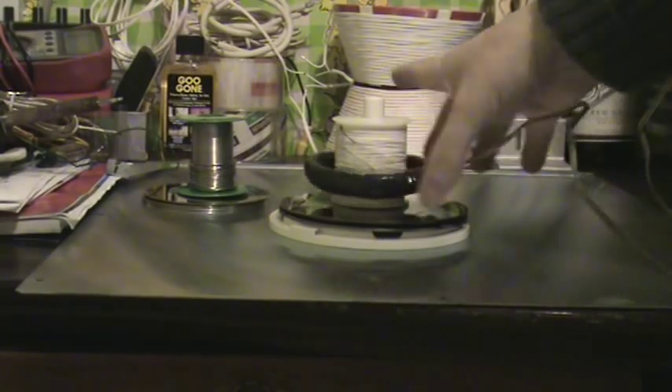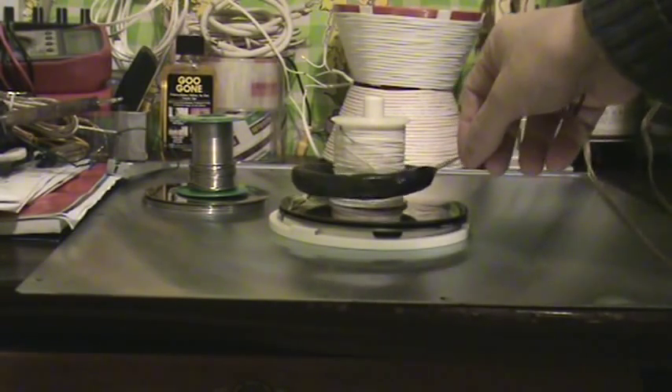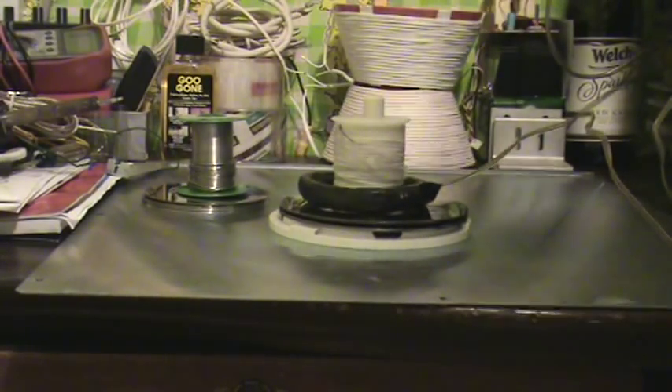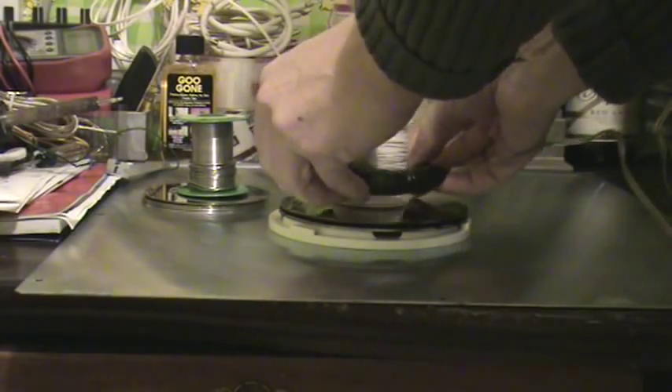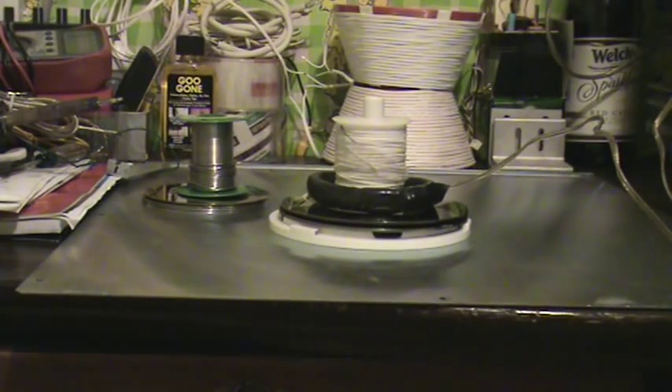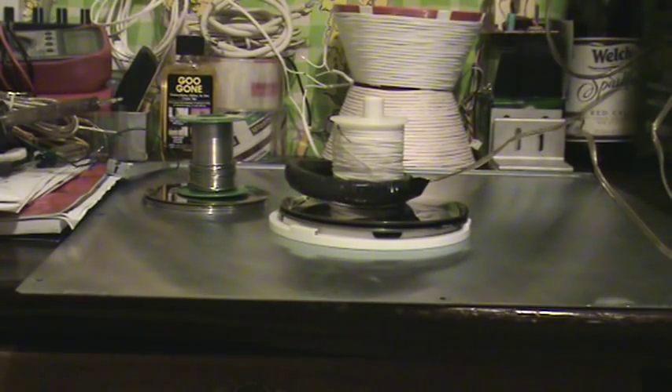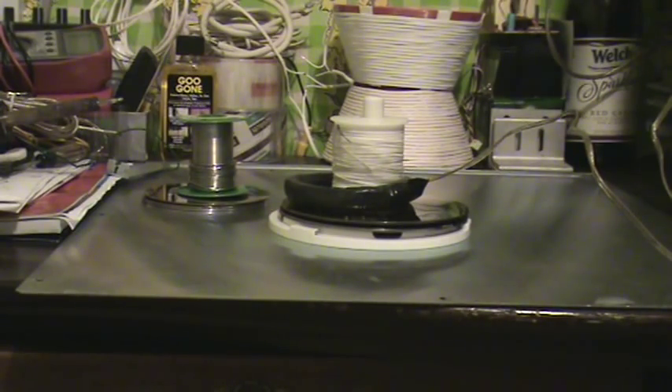As you can see, it floats — pretty nicely. And if it could find a way, it would float away. It also gets really hot really fast, though actually it's not too bad. Eventually it will melt the electrical tape that's holding the coil together. But there we have it floating on air at about 500 watts of power. That's the reaction: steel is attracted to a magnet, aluminum is repelled.